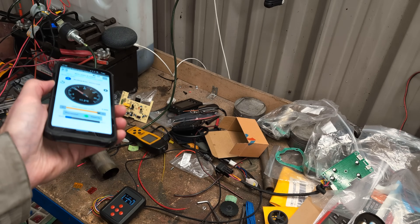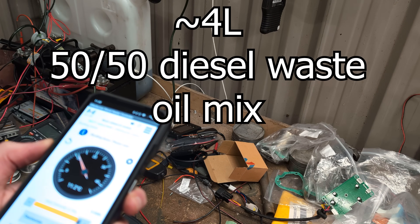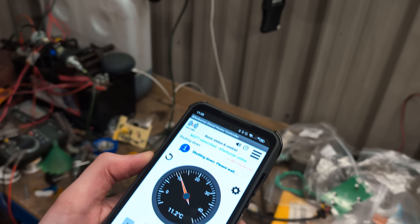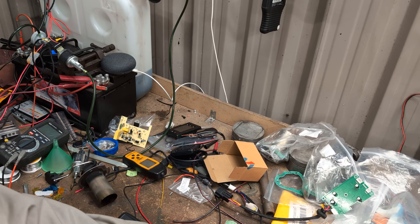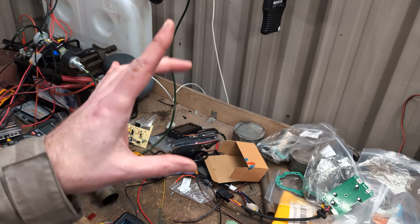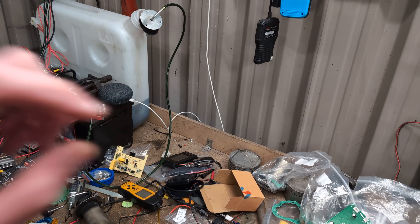I refilled the tank with about 4 litres of the waste oil-diesel mix and tried to relight the heater on the same burn chamber we'd used previously, which had already gone through four litres of the waste oil-petrol mix — but it will not relight. It's clogged to a point where it kept going while burning, but it now won't stay alight. So it's shutting down and we're going to take the burn chamber apart. According to the numbers the gentleman sent me, I'm aiming for 5% oxygen, and if I can get less than 100 parts per million of carbon monoxide, I'm doing well.